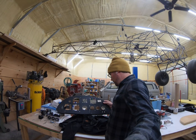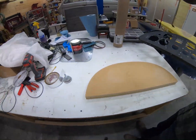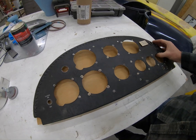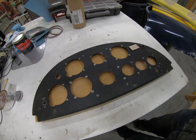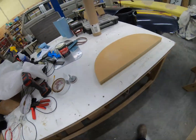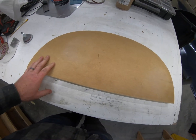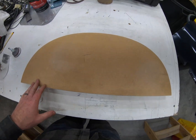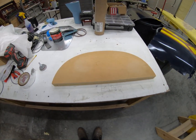Got all the instruments out of the panel. I took some MDF and made an MDF mold of the previous panel, undersized it so that when I have my six or seven layers of six-ounce carbon it'll come out to almost the same size as the original panel. That's done — I have my mold. The next step is to cover it in aluminum tape so it doesn't absorb any epoxy, then wax it, and then start cutting the carbon and the peel ply and the release paper.